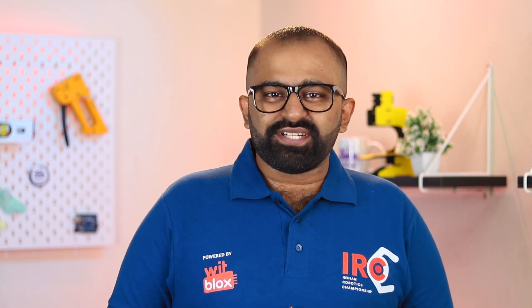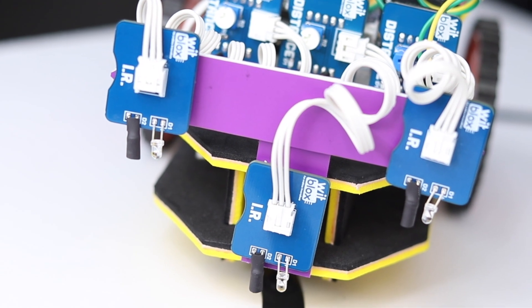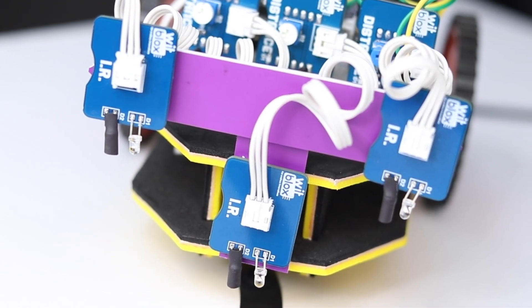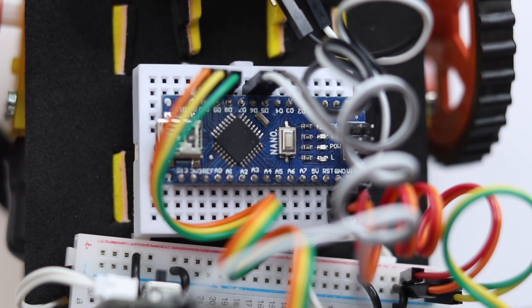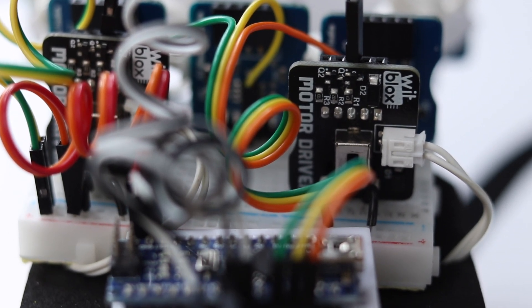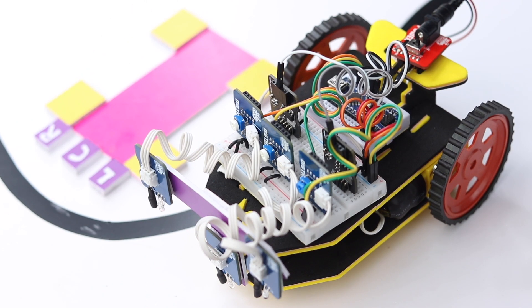Let's build the physical model of our project. Here we have placed three sensors. The arrangement of the sensors is dependent upon you. The only thing you need to make sure is the distance between any two sensors should be slightly higher than the width of the line. You can position your sensor at any height — just remember, the calibration settings change at different heights. The three distance sensors give their input to the Arduino Nano, which controls the two motors. In the model we showed four motors, but for this tutorial we will be using only two motors. You may add two more as dummy motors or dummy wheels.